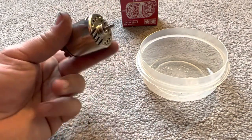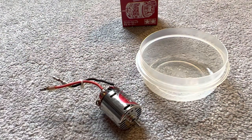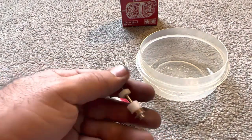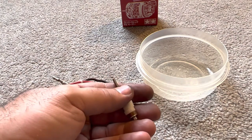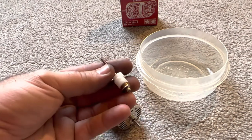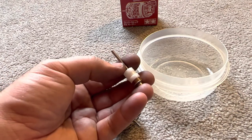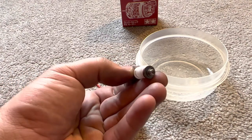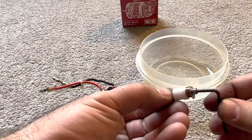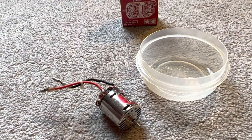That's pretty much the whole thing. For the arbor screw, it's an M3, probably about 20 to 30 millimeters long, allen cap head — so you can get a fatter allen wrench in there and really get some muscle on it to seat the bearing.